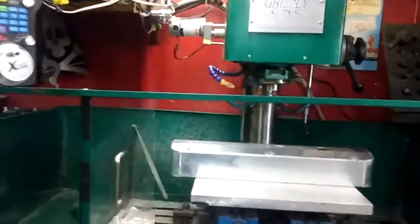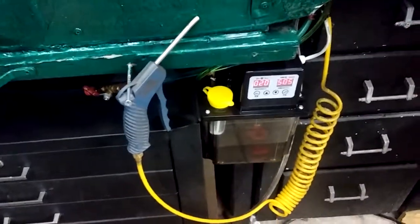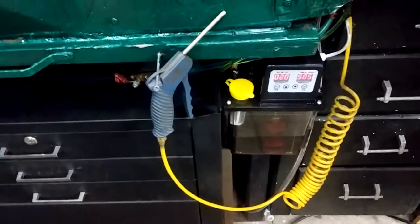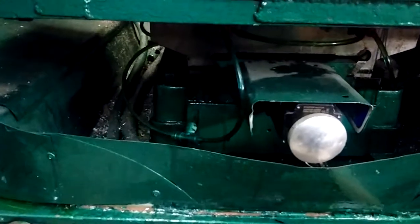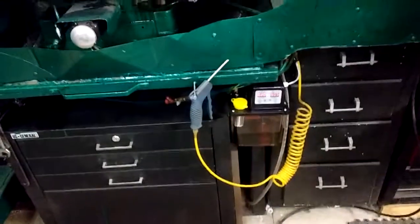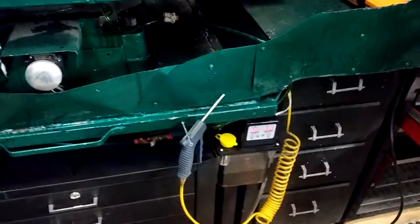So that's pretty much all I want to show - the round column gear motor. And then I also have the automatic oiler. That's been huge, because I already had it plumbed when I did the CNC conversion. I plumbed it for the ball screw and X and Y ways on both axes. So it had already been plumbed - just hadn't gotten oiled for quite some time.